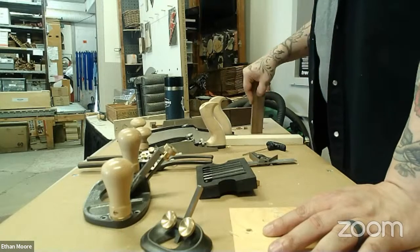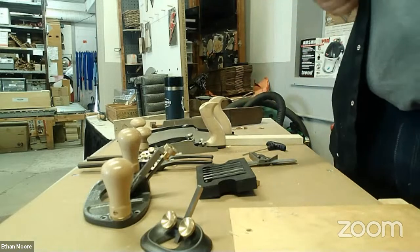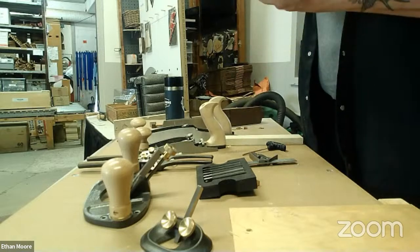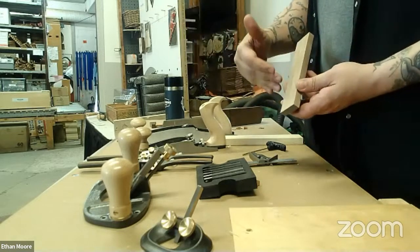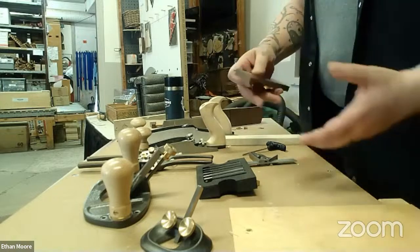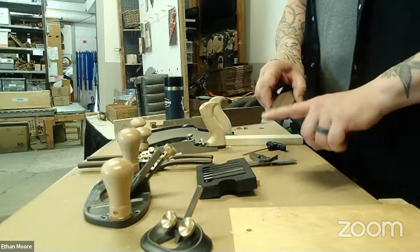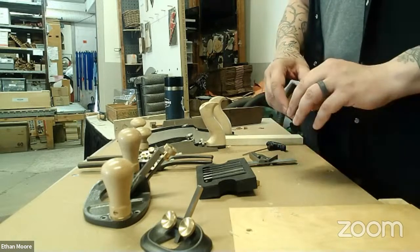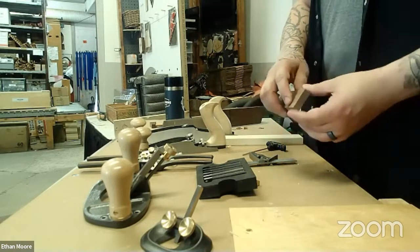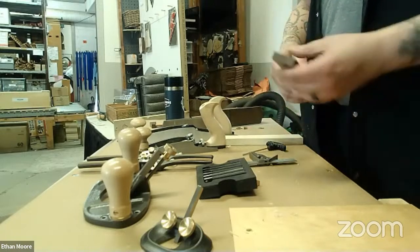There's a question on YouTube asking about sharpening — specifically, after you sharpen, do you remove the burr? Good question. When you do the bevel of the blade, whenever you do one side, the other side is going to have a burr. You're going to raise a burr, and you have to remove that burr on the other side. What I do is I sharpen it and then I don't take the burr off until my final stone. Because if I take it off on a coarser stone, I'm going to remove the polish I had on the back. Also, if it's too aggressive, you can end up ripping the burr off, and then you end up with a serrated edge, which will translate into your work.